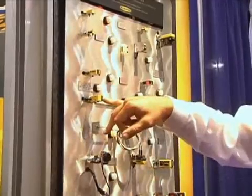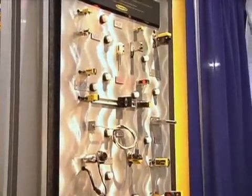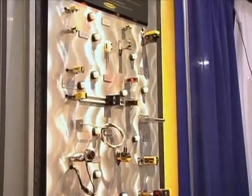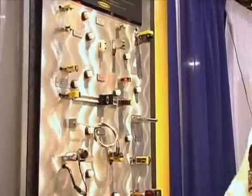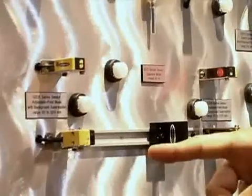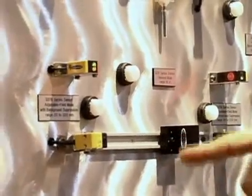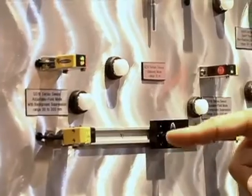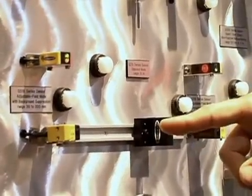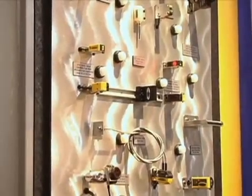We move up to the QS18 — this is the next line. It consists of both laser and LED light sources. The visible red light source is very common along these lines; it makes alignment very simple. The adjustable field is a very popular unit. It has an adjustment which sets that background suppression cutoff, providing very good gain and power within the sensing range while still able to ignore background objects.